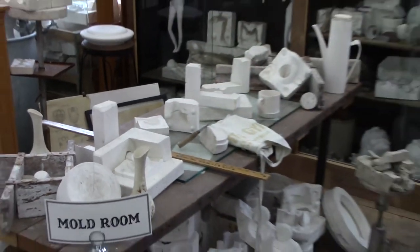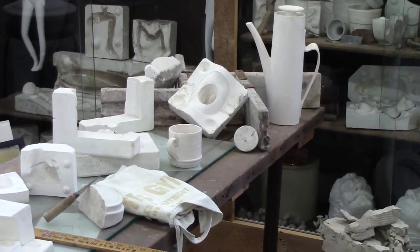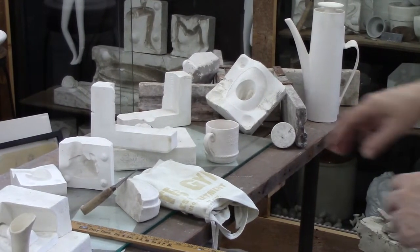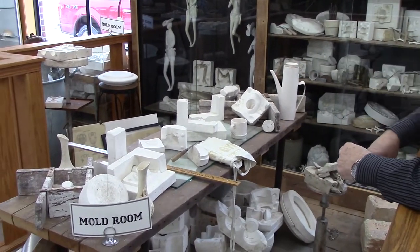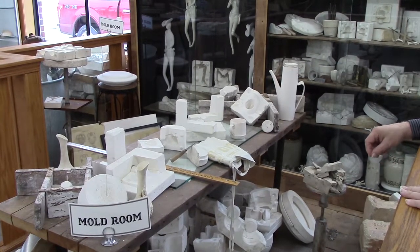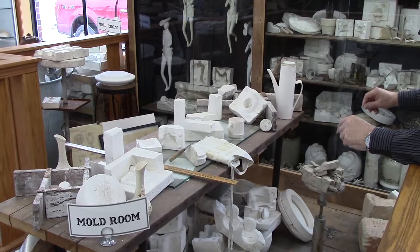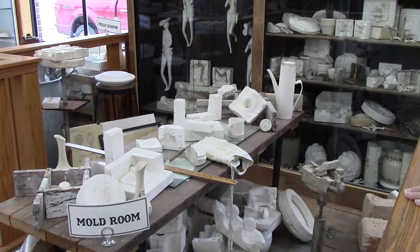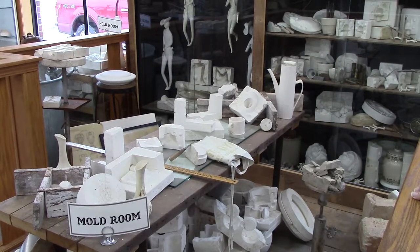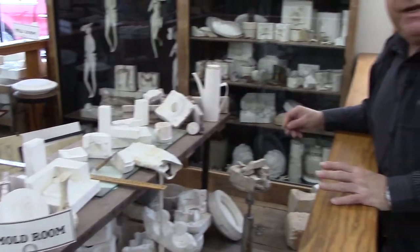You see this right here and here's the other half over here. They'd soak that up with soap as well, remove the air bubbles, put the two sides together, take a rubber band, put them together, pour the liquid plaster into it, make the two halves, and make the plaster Paris production molds. They'd make up approximately 300 to 350 of those, let them dry, and once they were dry, send them down to what they called the casting department.